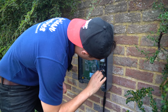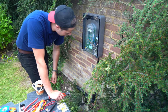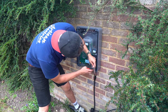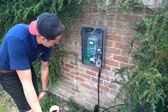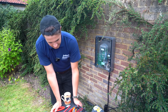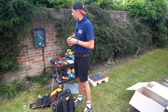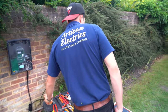Slight issue — we have a lovely crimped RJ45 connector made off with love, but realise there's no RJ45 point on the Anderson anymore. There's been an oversight: they don't do hardwired CT connections anymore — not Anderson's fault; if I'd paid attention to the last few I'd done I would have known. It's only via Wi-Fi that they do their internet. So instead I'm going to put a little TP-Link booster on the wall. Bonus: his Tesla has no Wi-Fi out here, so this kills two birds with one stone.